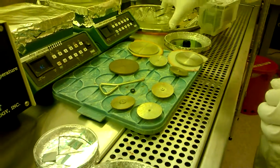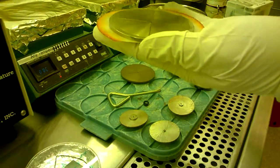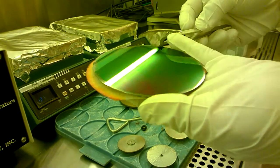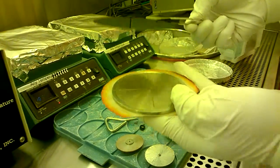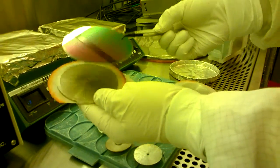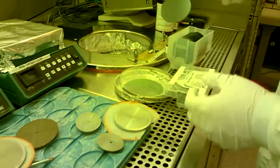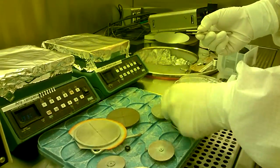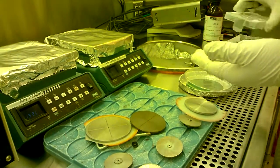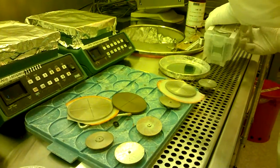And if you have a whole wafer, this is a 4-inch, you need to choose the 4-inch chuck for yourself. The rule is you have to use your wafer to cover the whole stage, and the stage also can't be very small. Use the whole 4-inch for this chuck, this is a 3-inch wafer, 3-inch wafer for this chuck, or for this one, this chuck is for the 2-inch wafer. This is the first thing: you need to choose the right chuck for the wafer or for the sample.